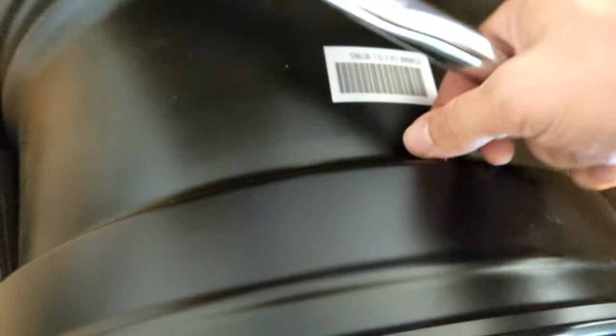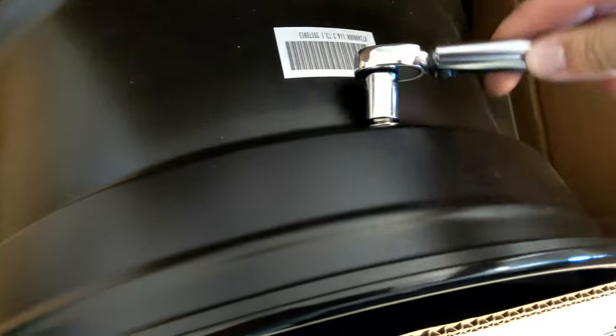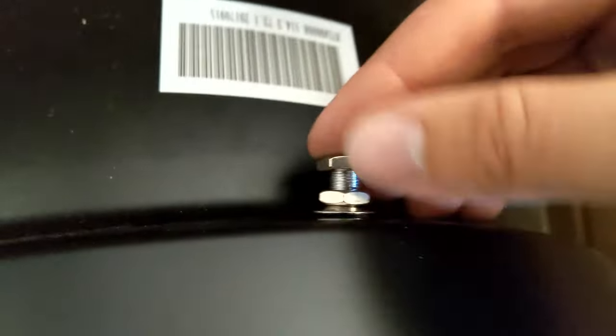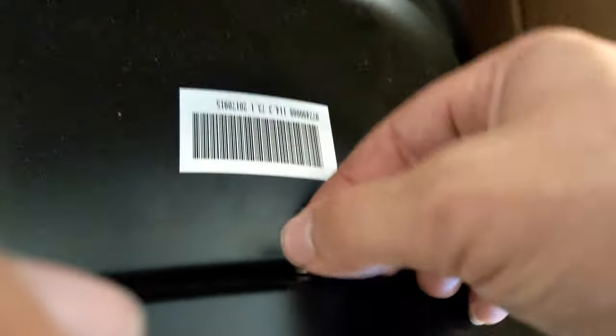For this particular design though — the other one you torque down, but this one you just tighten it down by hand; you don't really need a torque wrench. Tighten it until it doesn't go any further. Eventually when it starts to slip, you know you're good, because that rubber washer is very compressed to make a seal. Once it's tight, you take the second nut, put it on there, and tighten that down so it locks together and won't come loose.